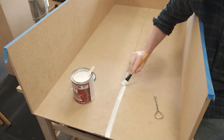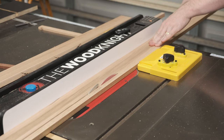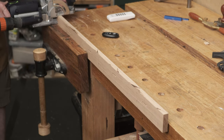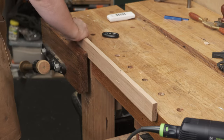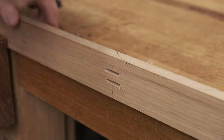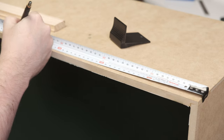Just like with the doors, I'm sealing the end grain of the faux stile with shellac primer. The vertical face frame parts need to be wide enough to span two cabinet edges and hide two sawtooth racks — all parts are 12mm so the face frame ends up at 48mm. Using a 4mm cutter in the Domino, two rows of mortises are cut. These are non-structural so size-0 biscuits would work great too. Once glued, this will draw the two cabinets together and hold them. With the tape off the cabinet edges I can lay out the matching dominoes to receive the face frame.